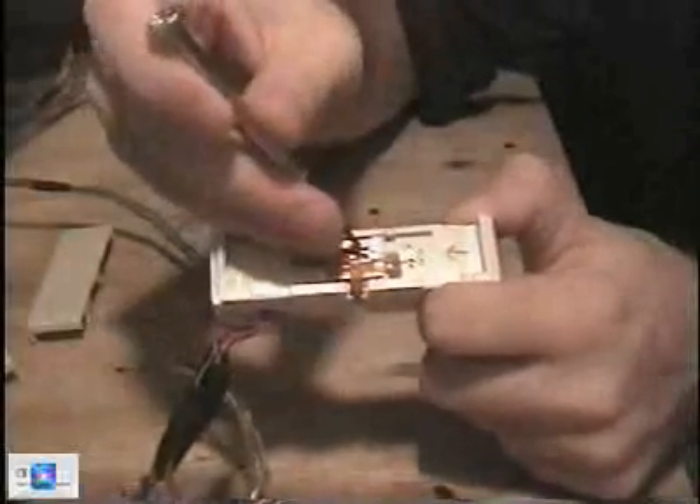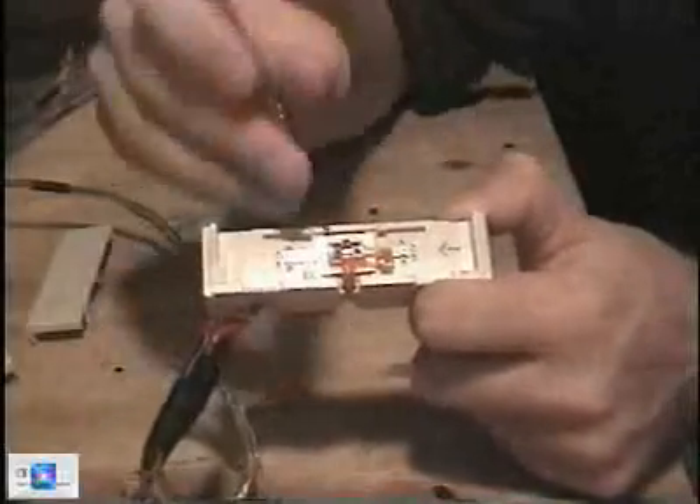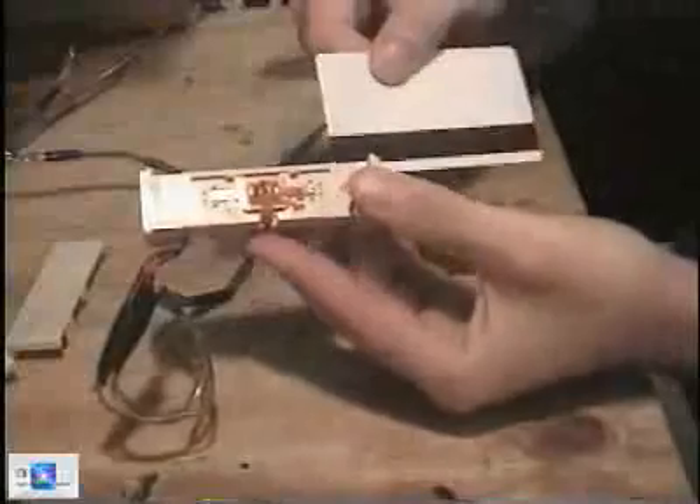It just has another set that can read bit streams. So all Omron would do if it wanted a track one only reader would be to move it forward one. You have to remember the three-track reader goes in, so the farthest down would be for reading track one, the next for track two, and the next for track three. So there's track two right there.